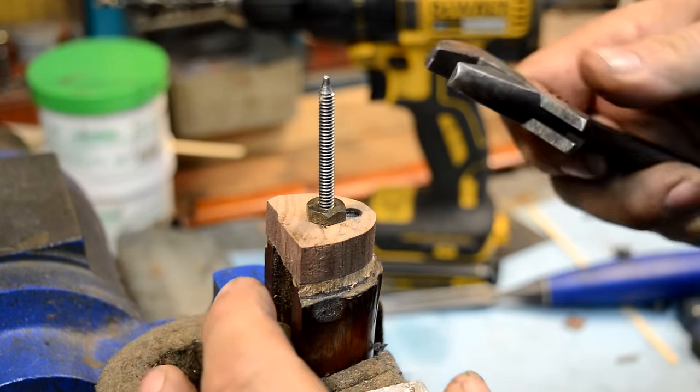So the next thing to do is to jig this thing back up in the vise and figure out how to get this whole can of worms back together again and glue it. I don't know if you can see it, but there's a little white blob right here. That little white blob is squeeze out. I put two more anti-rotation nails in it. I just tapped them in and let the glue squeeze out, but that's what it looks like when it squeezes out. I intend to have a small area of glass bedding in here. I intend this barrel to actually sit down in this mess.